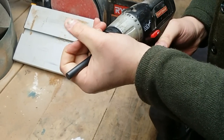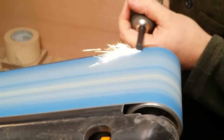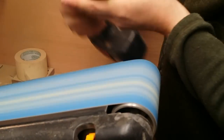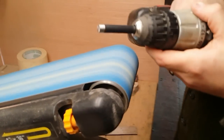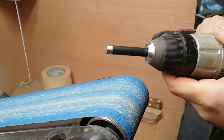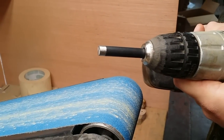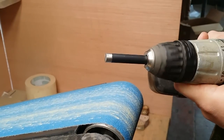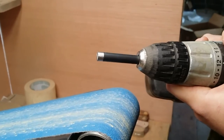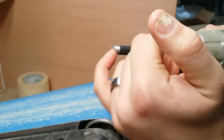I put it into a drill and bring it over to the sander. This gives you a very rough surface, almost like mini threads. The reason you do that is you clean it up and then do this, and keep your hands off it so you have a nice clean surface for epoxy or glue to adhere to. Sometimes with more manufactured fire steels, skipping this roughing-up process means the steels can pop right out of the heads. So it's a step I've taken — just rough it up to give a lot of nice threads to work with.